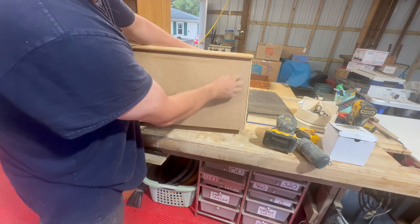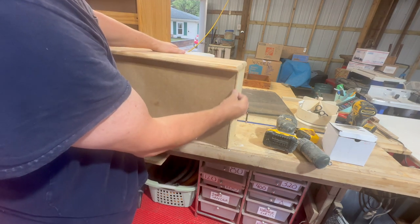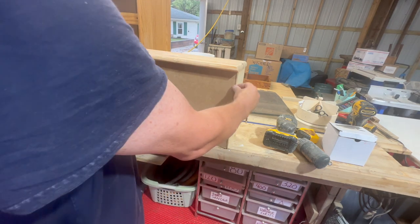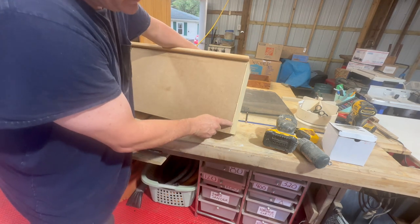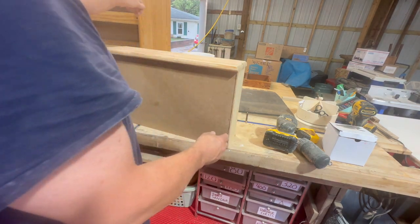So it looks like they routed that out to put these bottom drawers in. That only allows that little bit to ride on the rails, and those get worn down pretty quickly. They don't slide in and out smoothly, and that's why there's so much trouble opening that. You see that's been cracked and chipped away already, so I'll be sure to put a lot of wax on there.